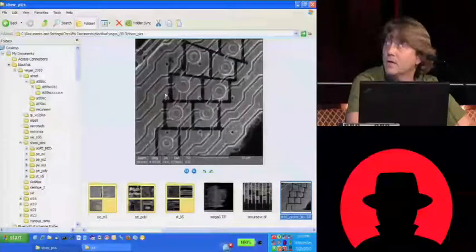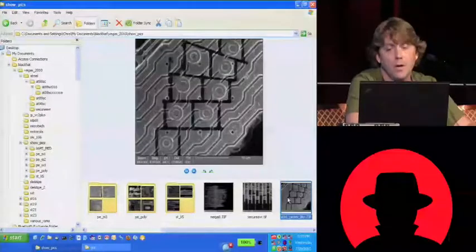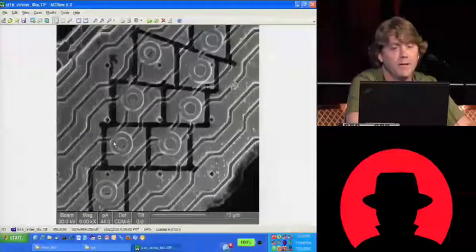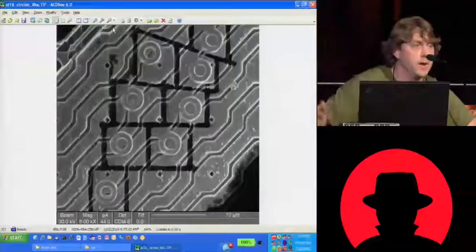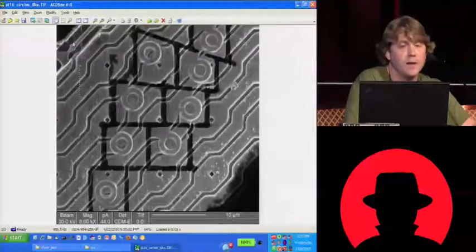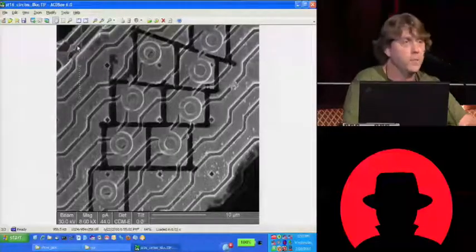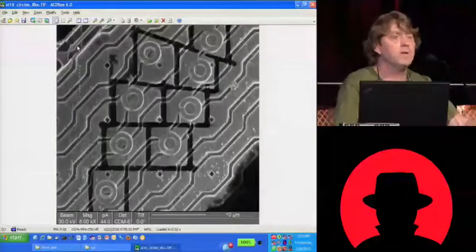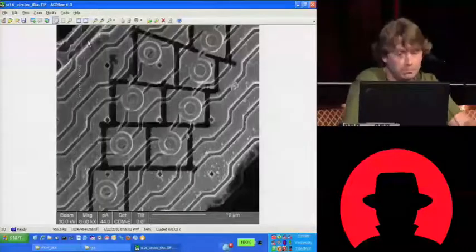This is all tungsten residue right here, or platinum residue. I have both metals in my FIB. So I drilled 8 holes and touched the bus line. The bus line is running exactly north and south on this picture. So from the top to the bottom, it's running down the chip. So I found isolated where the bus line was with a reference right here, but it's out of view kind of. But right in here, that's a hole that I dug to see where the lines are down on metal 3. I use a chemical called xenon difluoride in the FIB to do this without hurting the metal.